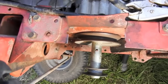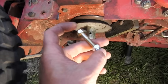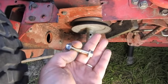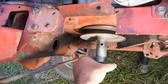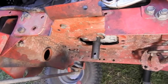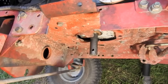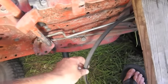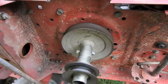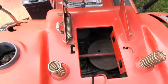Here's what the hole looks like in the crankshaft and pulley, and here's the bolt — it's a grade 8, 5/16th bolt, an inch and three-quarters long. The bolt was $1.39 and the locking nut was 25 cents, so about $27 total with the belt. There's a lot of meat left below this hole — if you want to go back to stock, put the stock bolt through, bend the belt guards back out, put those two in, put your pulley back on, and hang this belt on the wall. I just installed the bolt, tightened it up with my half-inch socket and wrench, and now it's ready to put the belt on. Both belts are back on — get the battery back in and it's test drive time.